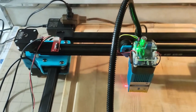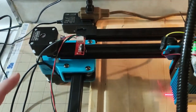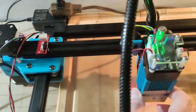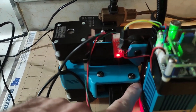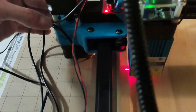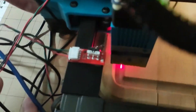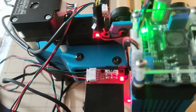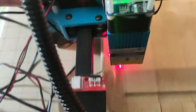Out in the workshop, the first thing you want to make sure is that you've set your limit switches to a point where it's going to cut off when you drag your laser over. Move the laser over and make sure it just hits the limit switch before it hits the casing. If it does that, you're golden. Then move it down and do the same thing — make sure the limit switch is triggered before it hits the end of the frame. As you can see, it just triggered right before hitting the end, maximizing the workspace on your laser.